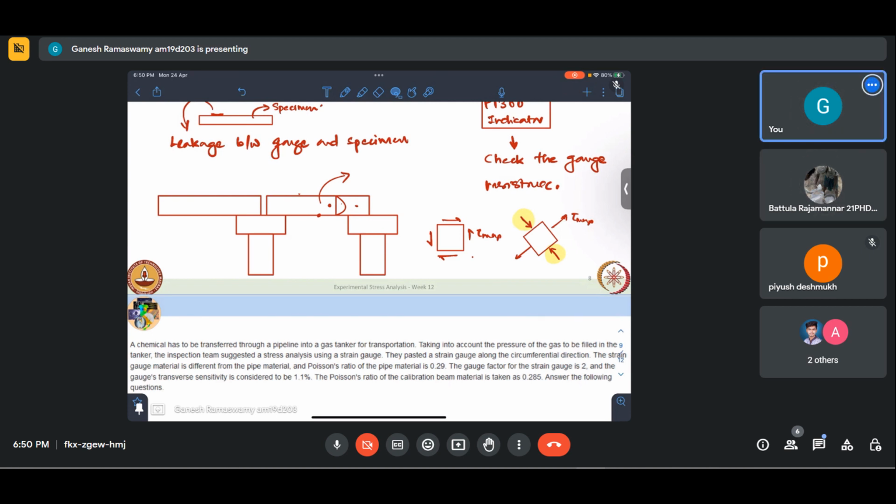Earthen dams are, no, but essentially these are bulk structures. So where is the strain or stress you want to measure? In case of optimized structures, because a dam is a bulk structure, if you see a dam, essentially it is a triangle, a somewhat glorified triangle. As you go down, the base also becomes wider from stability perspectives because essentially this has to hold on to water here. So this is water, and I'll have a distribution like this. The water will try to topple it, whereas its self weight is the only restoring moment about this heel. So in gravity structures, stress concentration would be only near the toe, and there we can provide local reinforcements and take care of that issue.